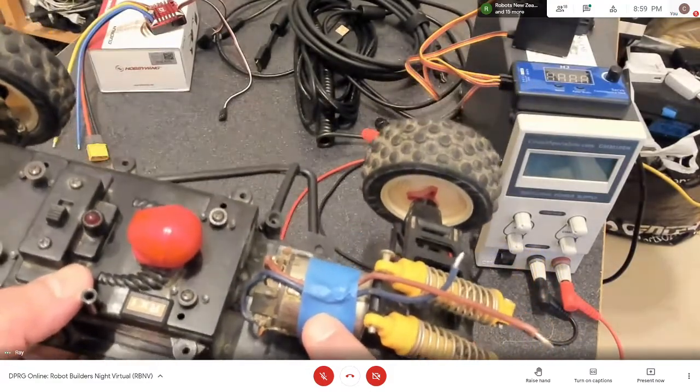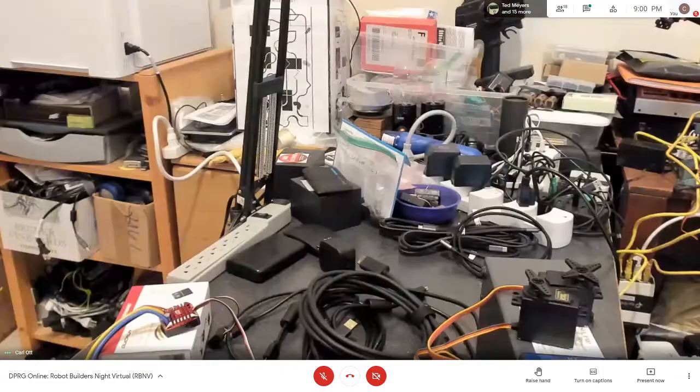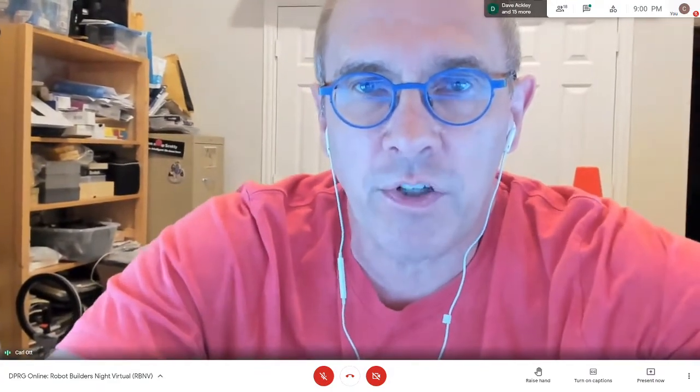Wasn't 7.2 volts a common voltage for battery packs? Yeah, I think it was of a certain generation, right? Not nickel metal hydride, 7 point something volts. Right. But since it's pulse width modulated, what could the failure modes be if I just give it a 3S pack and a different duty cycle? Should be the same thing.